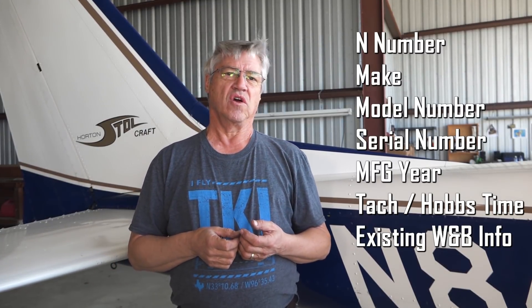Get the serial number and the manufacturer's year. Get the current tachometer or Hobbs reading, whatever you use for your maintenance records. If you've got the weight and balance documentation that came from the manufacturer, it gives you all the arms and locations — it's in your equipment list. One last thing people often forget: if there's an STC on the airplane — Bonanzas are a common example with tip tanks — those tip tanks often raise the gross weight. So you need to find out if there are any STCs that specifically change the gross weight numbers.